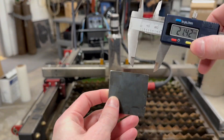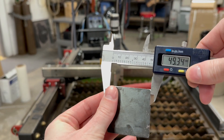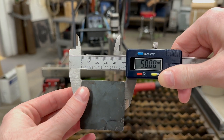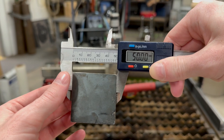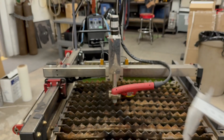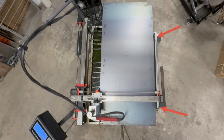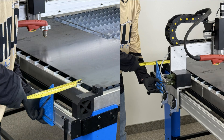With the current width that we have set on the table, we got 50mm right on the dot. After adjusting the kerf if you need to, we're ready to get things set up to cut the first section of the water tray slat. Next, we need to make sure the material is square on the table. Since we're using our 2x2, we can push the material right up against the gantry rail mounting plate to help us do this. You will also need to reference where the material is starting on the table so that we can use that information later on to move the material for the second section of the slat. When cutting on a 4x4 table, you'll need to use the gantry rail to help you get the material square.